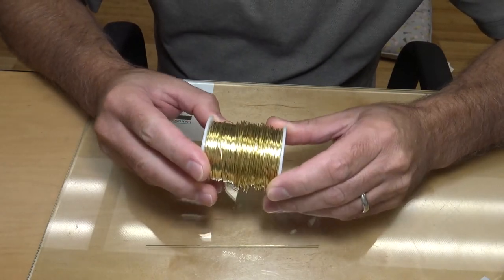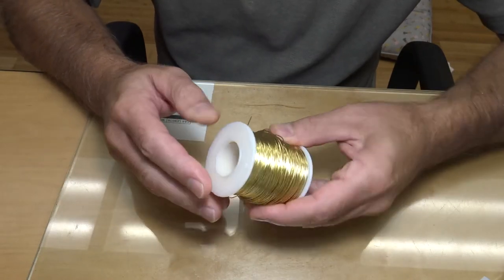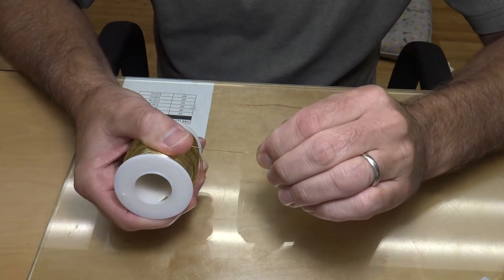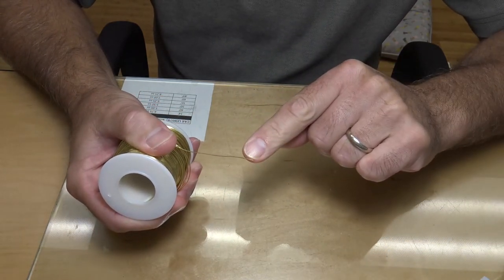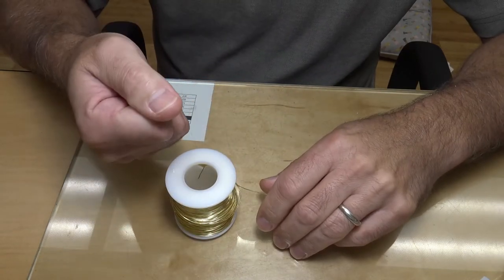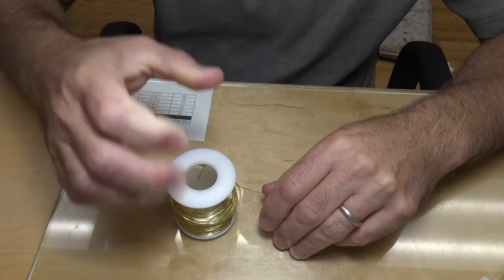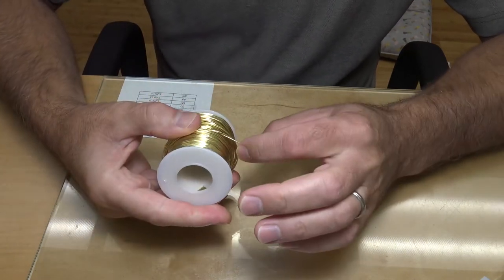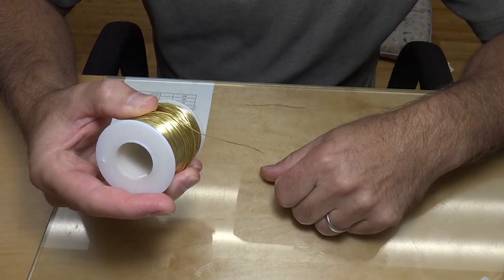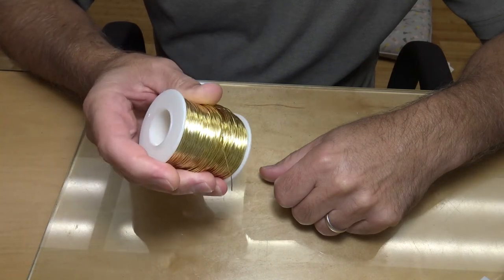25/1000 brass wire. Now, the reason why I say it's 25/1000, what you do is you take a length of wire and you cut it. You take an end, you secure that in a vise. On the other end, you take some pliers or something that'll hold it really tight, and you give it a good tug. It'll straighten the wire, it'll stretch the wire enough that it'll bring it down to 22/1000. So there's a lot of wire right there, so I can stretch it down to 22/1000.